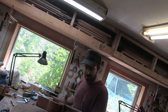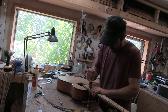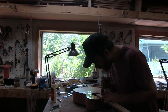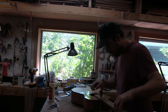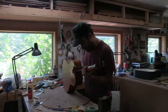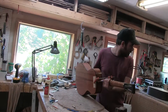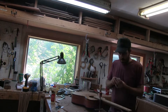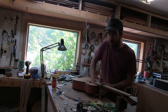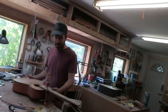I'm just going to do a little inspection. Looks like everything is sitting where it should be, so I'm pretty happy about that. It's nice if you actually have a caul that's smaller than your board is wide, because then you have easier access to your perimeter. Take my bolt and carefully get it in place. How tight do you want it? Fairly taut — you don't want to imagine yourself pulling that brass fitting. That bolt is not really what's keeping the neck in place; it's the tight dovetail fitting.